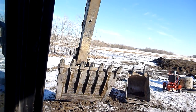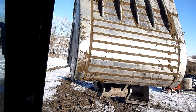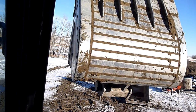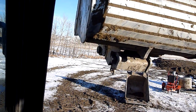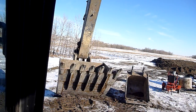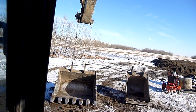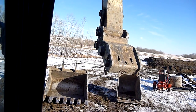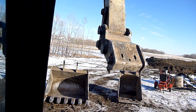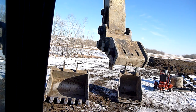Give it a shake. Sometimes they get a little stubborn. The wedge has come out of the bucket there, and you just take it off the front ears. You can see the wedge goes back in — there's a cylinder there to just move it in and out, and a couple of return springs to hold it in.